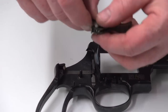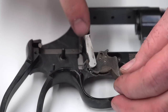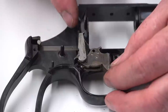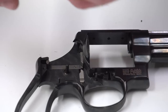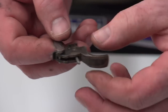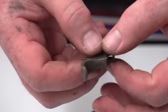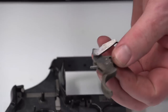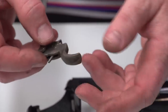The main thing you don't want to do is let the hand snap forward while taking it out, because it'll leave a nasty gouge on the recoil shield — very obvious. On some newer triggers, the little shaft that pushes the rebound slide back just slides in, so if you pick the trigger up, this unit can fall out. This particular model has it pinned in place, but newer minimum-parts versions just slip into place — an item easily lost if you're not careful.